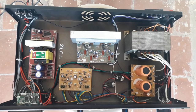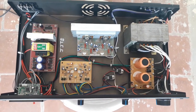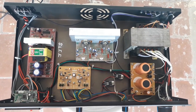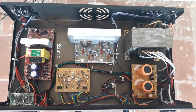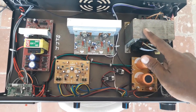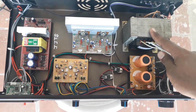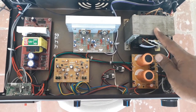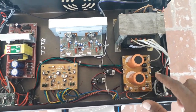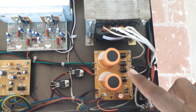What do you see in this amplifier? The TDA7294 requires a dual power supply, that is why we have to connect a dual power supply. Let's look at the power supply: it is 24-0-24, 5A. There is a 5,000 µF, 50V capacitor, and a 6A diode. This power supply is 24-0-24.